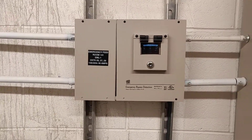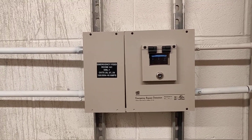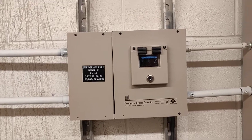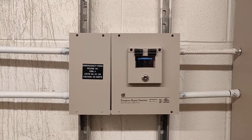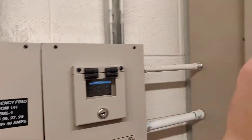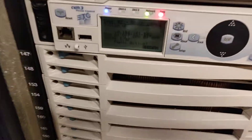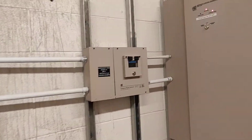Since the house lights are controlled by DMX, if you just applied full voltage to them they wouldn't know what to do. So the EBDK sends a signal out to give them a full DMX full-on signal. This is feeding signal to the transfer switch and our racks — you can see it says 'panic active.' We obviously still have main building power.